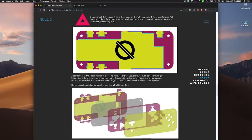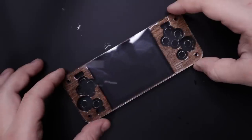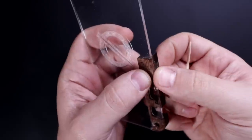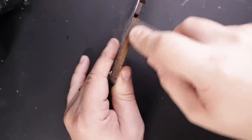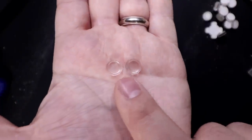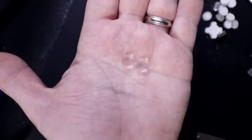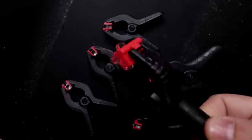It works great but be really careful with the thin pieces — I used a piece of perfboard to clamp those down without breaking them. You do not need to attach the front spacer with the front plate, but I went ahead and did that anyway to get that nice glossy finish on the front wood spacer. One thing I wish I had done differently: peeling the glue away from the edges also takes away some of that charred surface. I wound up sanding it down and staining the edges, and it looked nice anyway. For the buttons, these are the bases — they're wider than the buttons themselves so they won't fall out from the shell, and they have a circle etched into them so you can easily line them up in the exact center.